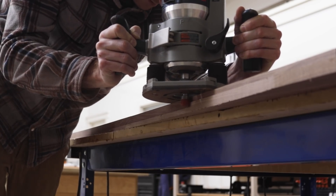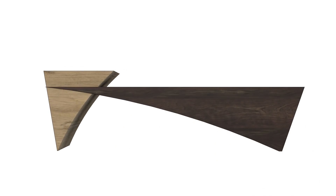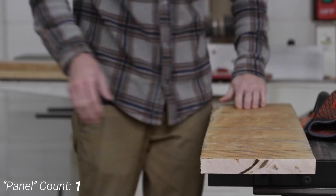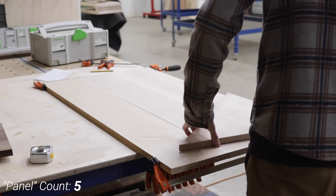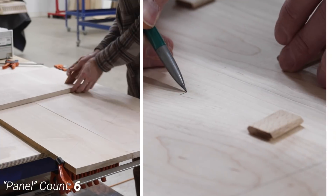With the two main walnut side panels pretty much finished, I could get to work on the other two main parts of the bench — the walnut slats, and the maple panels which create the opposite end support, as well as become the interlocking slats. The main thing I needed to consider was that I milled all of these parts to the exact same thickness. That would allow everything to be spaced evenly across the width of the bench and let everything line up properly. I first started by making the maple panels — I needed 10 of these, and I made them in a very similar way as I did the walnut panels. I once again made one panel on its own to become the template panel, and once I had that one ready to go, I prepared larger panels that would yield four maple panels each. I could dry fit those together, trace out my template shape, and cut in dominoes without risking exposing them on any cut lines.